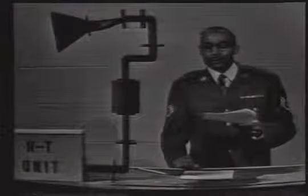The purpose of the rotating joint is stated under item three of your TVI guide. The rotating joint enables us to connect a rotating section of the waveguide to a stationary section electrically, yet keep them separated physically. 'Electrically' goes in the first blank, 'physically' in the second blank. You will also note that the electrical characteristics of the rotating joint are identical to those of the fixed choke joint.